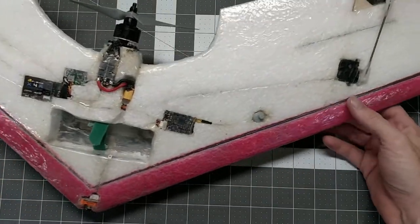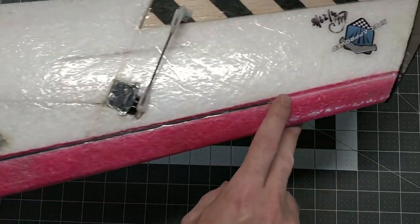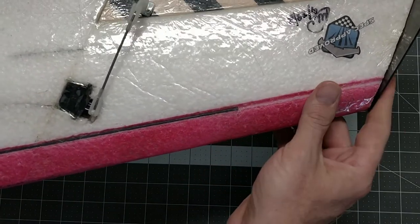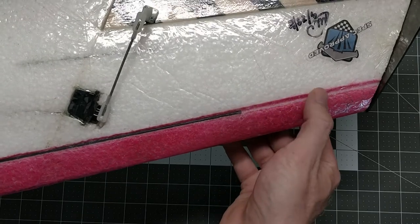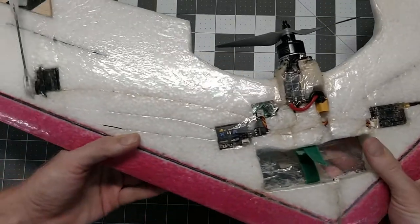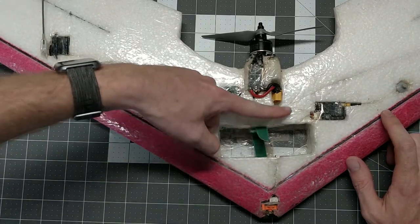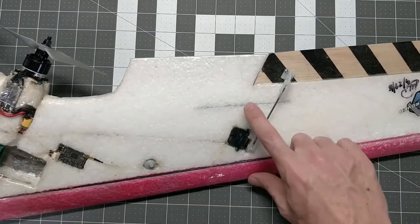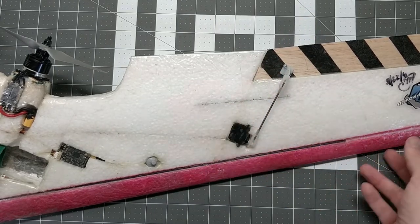The sparring on the spec wing is pretty easy, especially with the V2 kit from VAS. Alex cuts these channels out here in the front — you can see the channel goes all the way to the wing tip, but you want to drop it a few inches short. This gives you some flexibility so when you strike a gate or something, you don't tear up the wing. I might go a little bit longer on the next one, but you definitely don't want to go all the way to the end. You can't really see my top spar, but there's an I-beam spar that comes across right here and it's embedded way down in this cut.